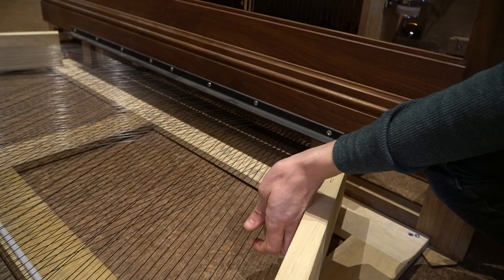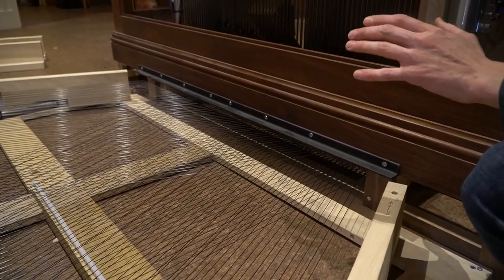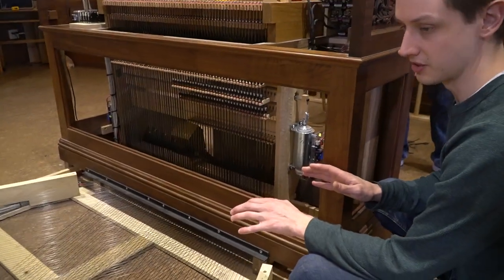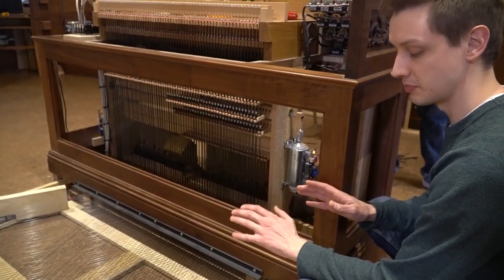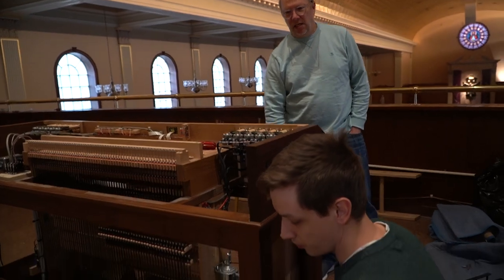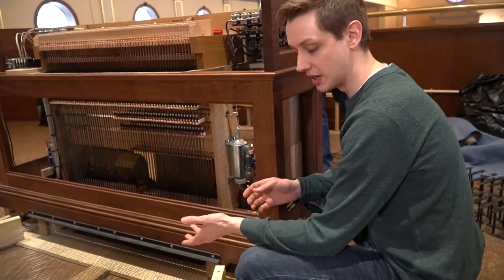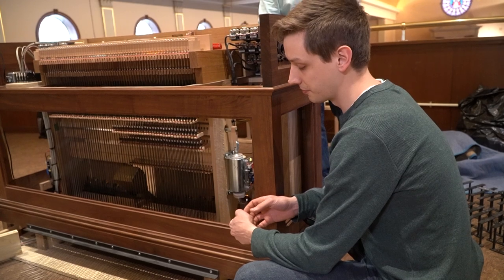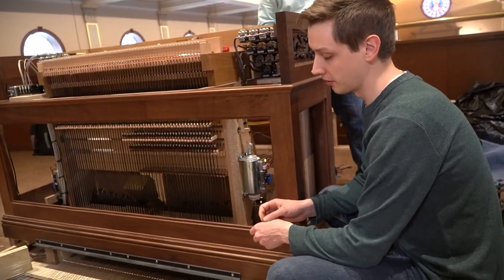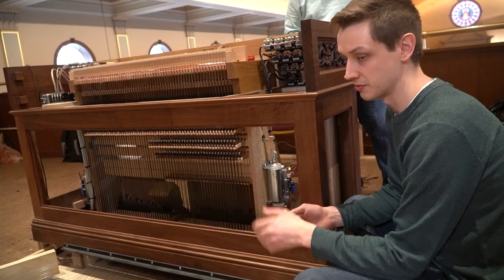And so that then pulls this thinner carbon fiber wire. We use carbon fiber because it's extremely light — we're minimizing the amount of mass in the action. The goal here is to have as little friction and as little mass, so that the organist has as direct a feeling and control over the valve at the foot of the pipe as possible. In the old days, they were usually made of wood, a light wood such as cedar or pine. We've done plenty of organs with pine trackers as well, but for instruments that have longer actions, we find that carbon fiber is worthy. It's a little harder to glue, but it has really great advantages — you can stack them much more compactly, they have less mass, and if it's a long run, that's really important.